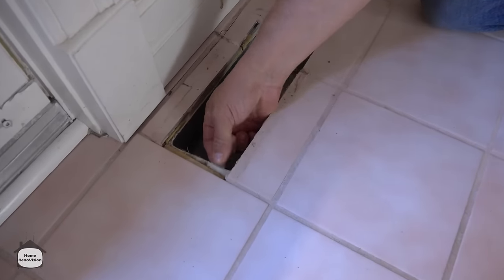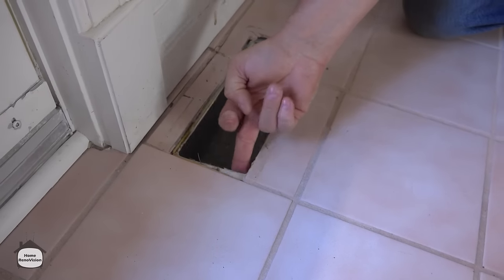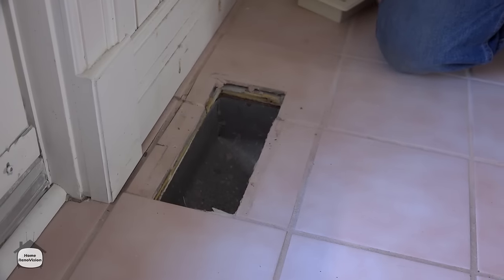In our area, the building code has us using five-eighths tongue-and-groove subfloor plus a half-inch plywood. It still falls a little bit shy of the inch and a quarter of substrate we need — still an eighth thin. The reason this is a cheat: underneath the plywood right here is existing vinyl floor, and underneath that vinyl floor there's a quarter-inch plywood. What happens is a tile guy comes in, screws down a half-inch plywood over your existing floor, and tiles right over that surface. This is the most common installation today. It's a huge cheat. As a result, they lose the ability to screw the floor down to the joists and get rid of the squeaks.